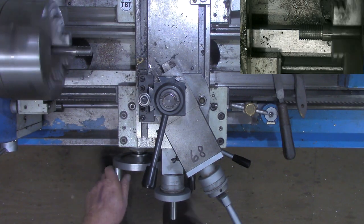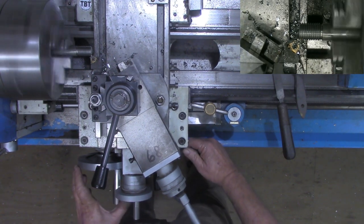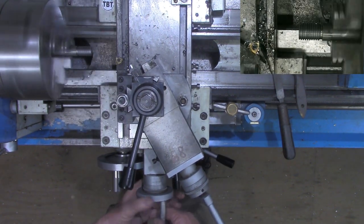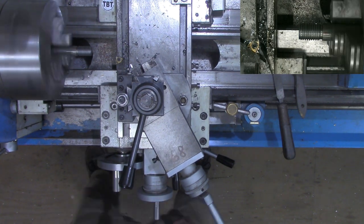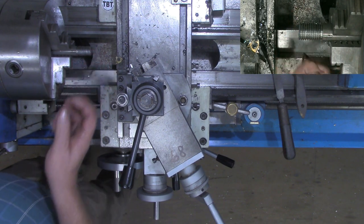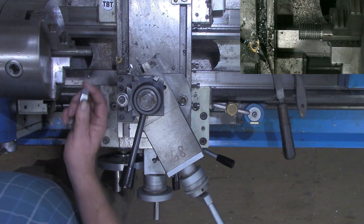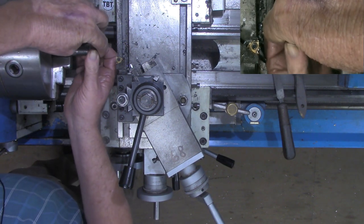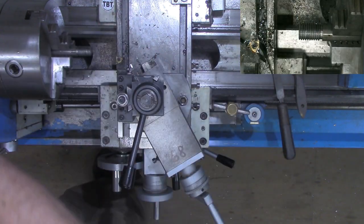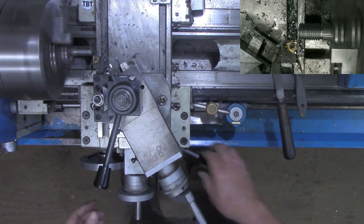Almost. All right, we're going to take 2 more 1000ths over here. Remember I said that this workpiece was a full 5/8, which is almost 10 thousandths bigger than the material. I'm sorry, 10 thousandths bigger than a 5/8 off-the-shelf bolt. So we may have to take several more passes through here. That's just a few more thousandths there.